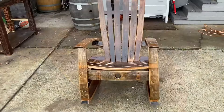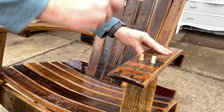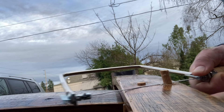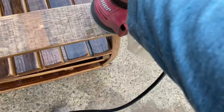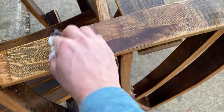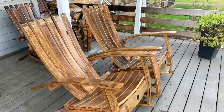Getting out the Forstner bit again and we're going to inset the screws. This is the worst part for me because when you think you're done, there's finish work to do. We're going to fill these holes, glue it, set the dowels in, and we'll wait for it to dry before we can sand it down. This chair layout has 16 holes to fill. Once it's dry, we saw it off and then we sand. With the sanding, you're going to knock off the color, so we're going to do a little bit of stain to touch up. Once the stain is dry, we'll put poly on it and then we'll be all done. If you made it this far, thank you so much for watching - we just saw it beginning to end, building a wine barrel rocking chair. If you liked it, like, subscribe, follow, do the things. Appreciate it. Until next time.